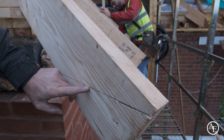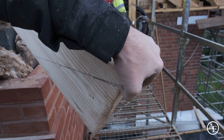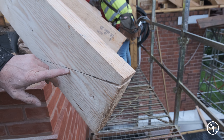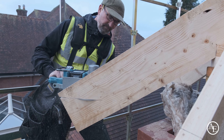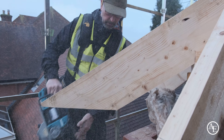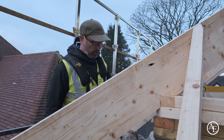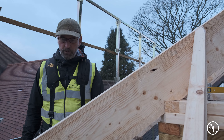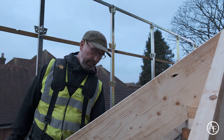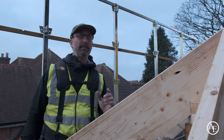You can see I've been cutting all the way along here, but the reason I cut this back bit out here is because the back of the blade was catching. I always like to lead the line slightly in. You can hear the blade binding there, so I went back on myself, cut a little bit more out, and then went for the cut again. It's really important to listen to the blade, listen to the tools. I was taught that in the early joinery shop, and that's the same with routers - when using router cuts, always listen to the tool.